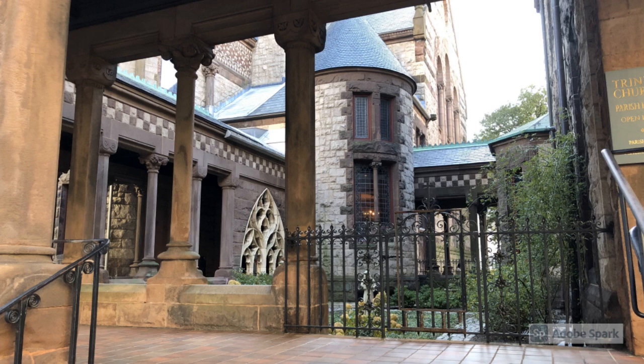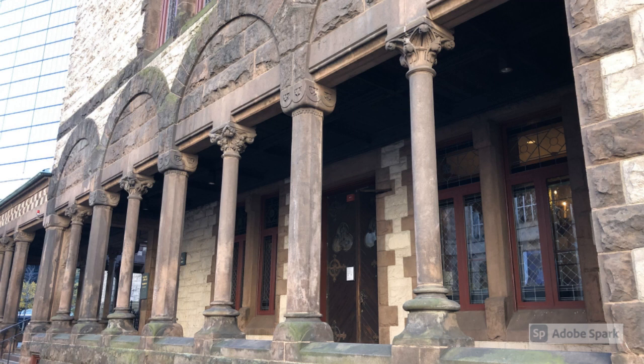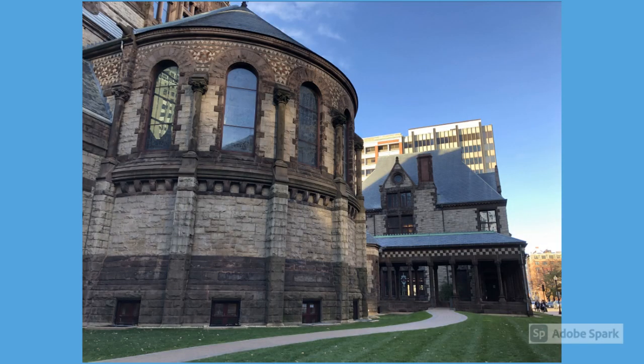The stone used was Dedham granite. The building's plan is a modified Greek cross with four arms extending outwards from the central tower, which stands 64 meters or 211 feet tall. Having been built in Boston's Back Bay — which was originally a mud flat — Trinity Church rests on some 4,500 wooden piles, each driven through 30 feet of gravel fill, silt, and clay, and constantly wetted by the water table of the Back Bay, as they will rot if exposed to air.